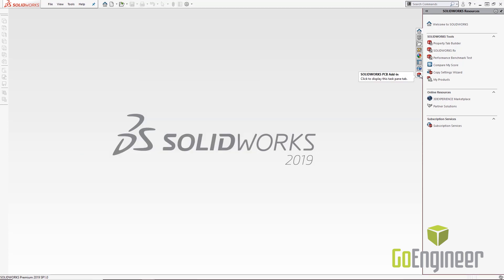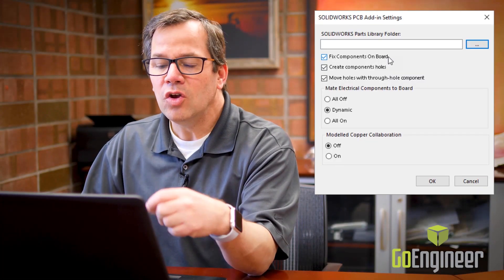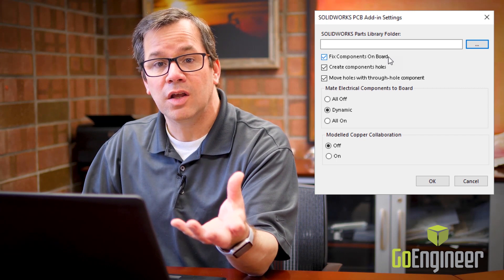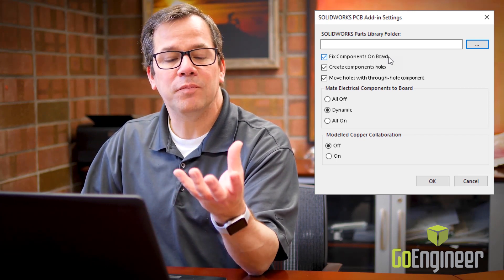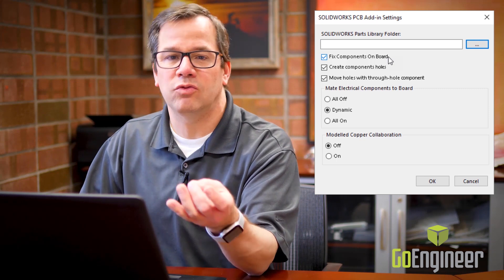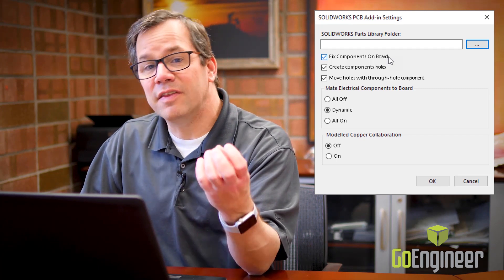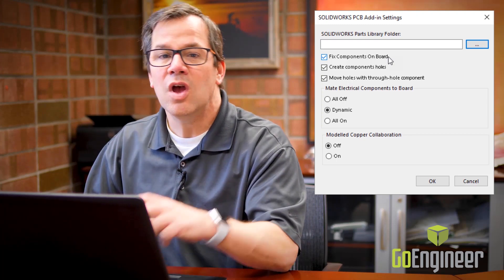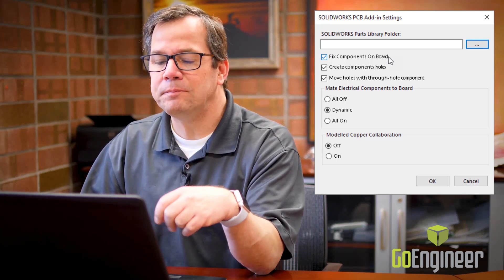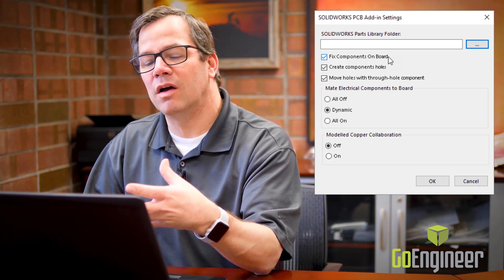In the settings, the first option is where you want the component files to be stored. Inside Altium Designer, when we create footprints we add a 3D body — something you draw, or insert as a free body such as a STEP file. You also have the ability to use Parasolids as well as actual SolidWorks models. Anything you download from 3D Content Central can be used inside Altium Designer or Altium Nexus, and that information transfers into the vault and to the SolidWorks user. Component files can be placed in a local directory, a network directory, or even SolidWorks PDM.